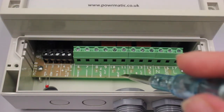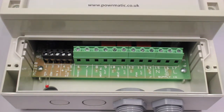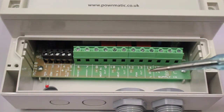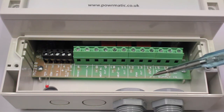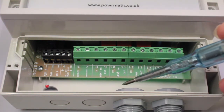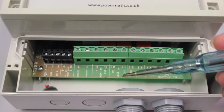The next few terminals — fan, heat low and heat high — are volt free terminals, giving you the facility to bring in a live supply from your heater into your in terminals, or by using the live output to link across to these terminals. The MC 200 gives you high low facility as well as single stage operation. If using single stage operation, we only use the heat low terminals.